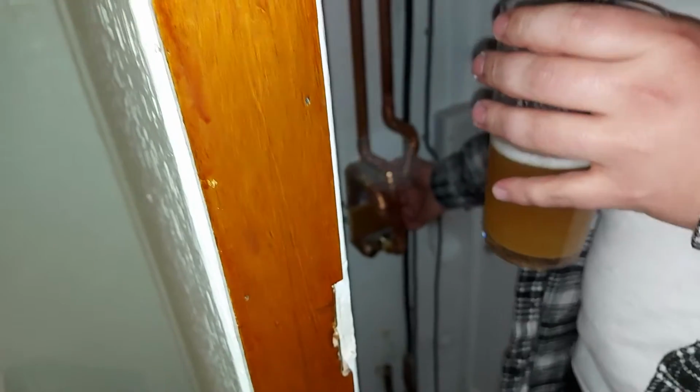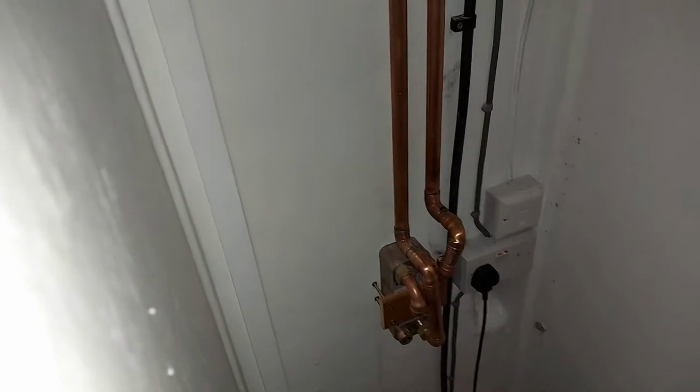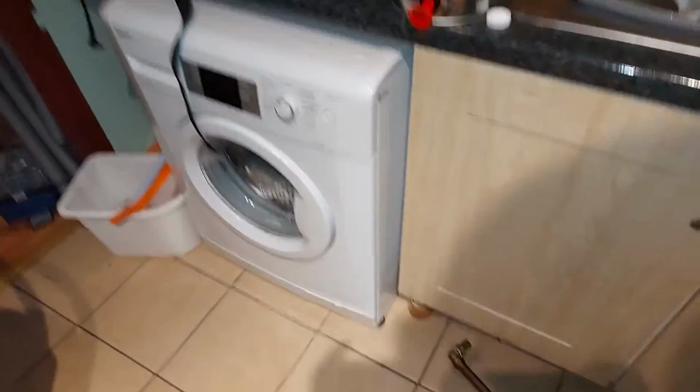This is my wall, right? Yeah. Black mould all the way fucking down it. They drilled back to the piping due to technically you should have took the shower off before you took the fucking pipe, the fucking wall off. And then you drilled down to the, see where the fucking leak is. To find out all this is soldered completely to the joint, and you can't fucking do anything for it other than saw off, turn the mains off, and then completely rebuild all of this. Yeah, that's ridiculous. Because the reason I've done it like that is with threaded connections, so you can actually take it off and flush that heat exchanger if it gets filled with crap, you know. Sean, I'm telling you, your knowledge is fucking. Because the main water cut off to this house is actually behind the drawers, eh? But you can, but How am I getting this pint? That's the real question. Sorry.